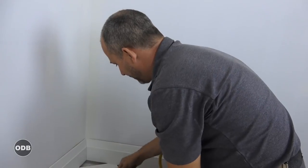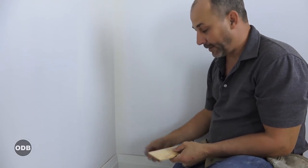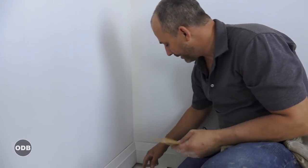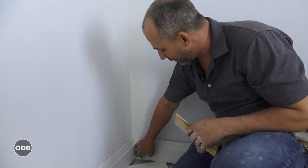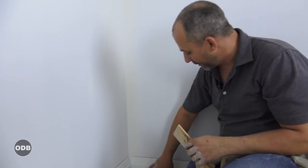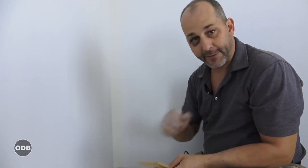That's the process you're going to need to use at almost every corner, because every corner has the same phenomenon — you're going to have two pieces of drywall meeting. If you build a room perfectly square, good for you, but as soon as you put mud on the wall you wreck that. You're always going to have this concave action in the corners. Having shims handy to nail your corners when you're using big fat trim like this will help guarantee your joints are always pretty. Glue them first because you can't get in there to nail them together, and then once you've attached this side using the same shim technique, just fill in the gaps, keep the baseboard straight, caulk it, and you're good to go.